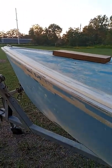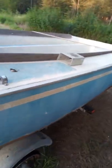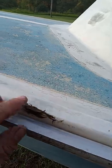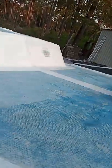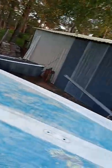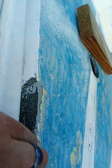I've also started sanding the top part of the deck. It's all got that same sun-damaged powdery white effect, but it's just in the paint — not into the fiberglass. I'm sanding it down and wire-brushing the grip mats because I can't sand them smooth; I want them to stay grippy. I'm going around and puttying over any little chips, then sanding those smooth. The first step is hitting it all with a two-part epoxy marine primer to give a nice base for the paint. There's a small repair where it looks like something hit the deck.